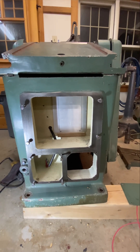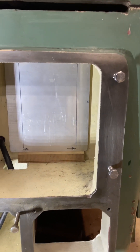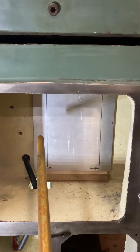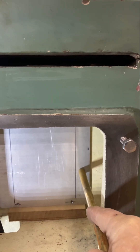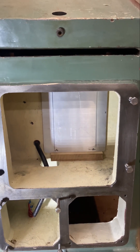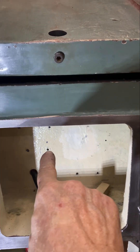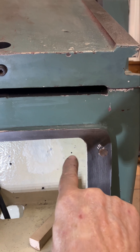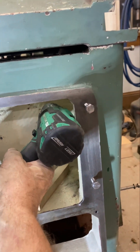I've got the plate where I want it to be. I'm going to tap on either side of this plate for quarter-20, and then make these little standoffs which bring the head of the screw up to the face, so installing and removing this will be way easier. I've marked the holes — there and there. I'll have to drill this one from this side and that one from that side, so I'll have to transfer those holes to the opposite side — the drill can't fit over there.